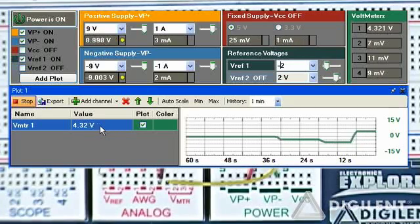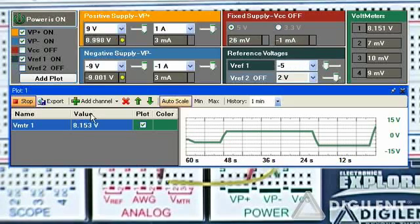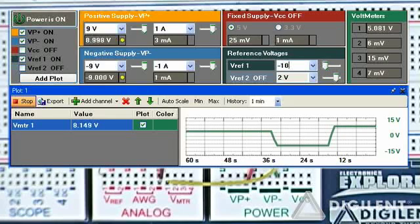With a negative 2 volt input, I should get about positive 4 volts. Now that's up to the point where we get to saturation. The positive and negative supply voltages give me a maximum possible range of the output, and the output will generally be limited to a voltage that's a volt or two within that range. If I try applying 6 volts, I should get negative 12 volts out, but I'm actually getting negative 7 volts — I can only get to within about 2 volts of the negative power supply. With negative 5 volts in, I'd expect 10 volts out, but I can only get to about 8.15 volts. And if I go to negative 10 volts, the output is not really going to change at all — it's limited by the power supply itself.